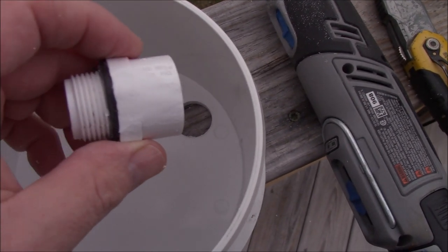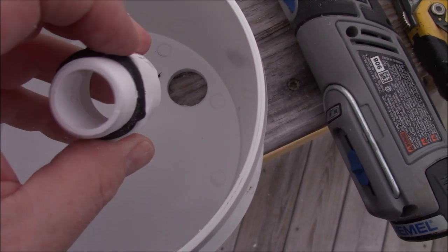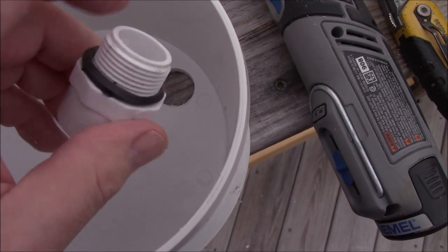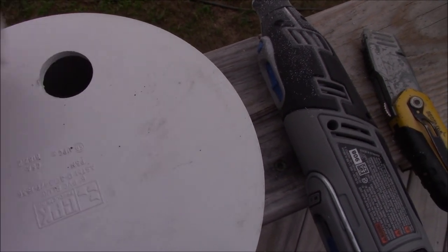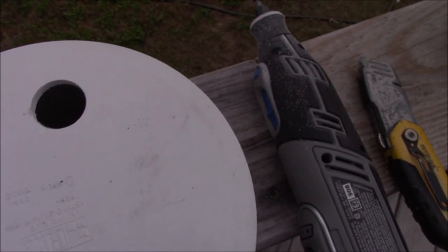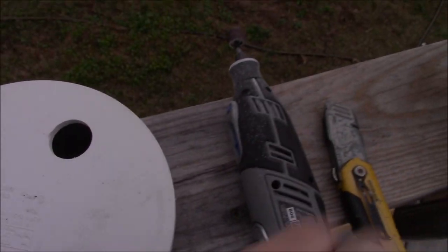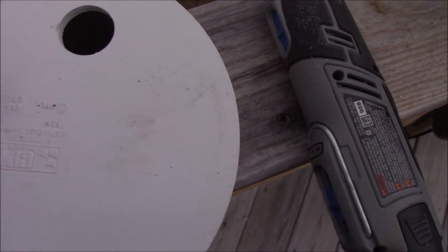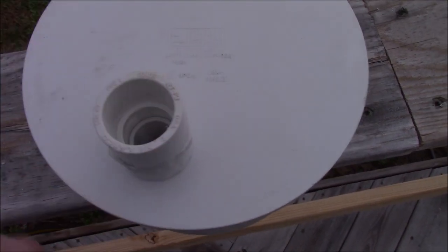These two fittings fit together — you can find them in any big department store like Lowe's or Home Depot. What I'm using as a gasket is the little piece of nylon or rubber from inside a garden hose to create a seal, going around the 3/4 inch pipe. The hole doesn't fit exactly, so I used the drill to wallow it out while it was in there, then finished it off with a razor blade or box cutter by going around the edge and removing a little bit of material. Here's what the finished product looks like — I can stick a regular 3/4 inch PVC pipe in there.